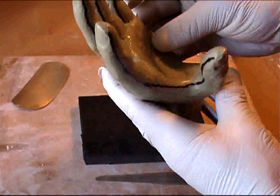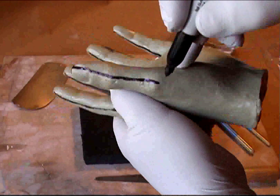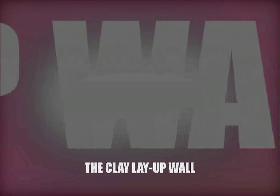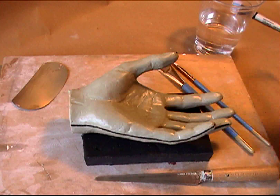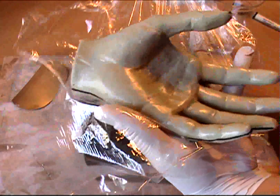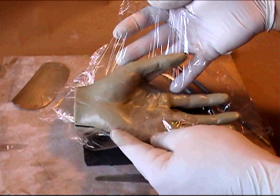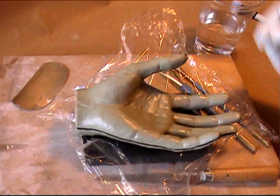The reason I do this is to show where the clay will meet on the sides. You don't need a lot of supplies to make this mold, but you will need some water-based white clay to do your clay layup wall, as well as a wooden board — a cafeteria tray will work just as well. You'll want some cellophane to cover the back side of your sculpture, the one that will be exposed to the clay. This will protect it from getting any important details filled up when you're making your mold.